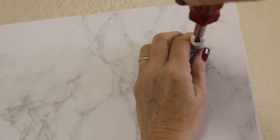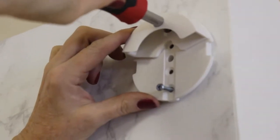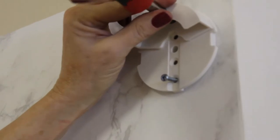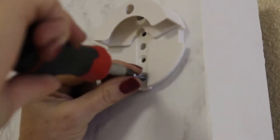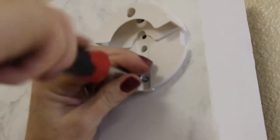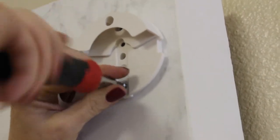Now this is if you're working in wall board. We've tapped both of our anchors into the wall, and now I'm going to go ahead and put the screws in the top hole and the bottom hole and just screw that in. The important part here is that we don't cinch anything down too tightly.